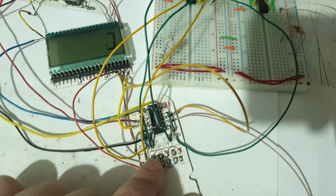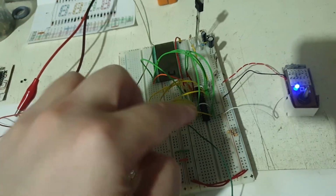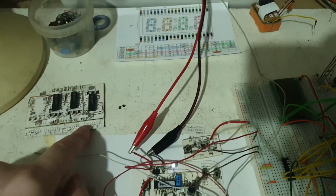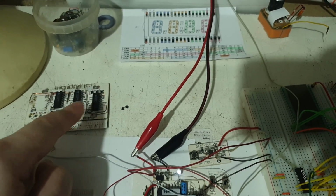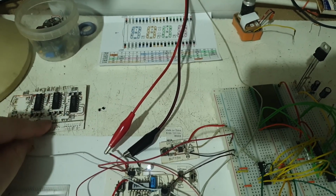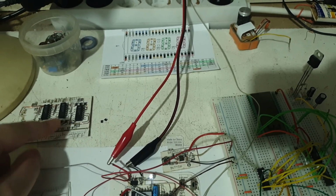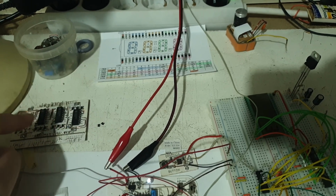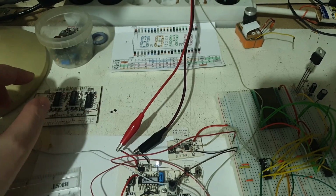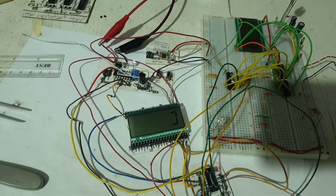So the next step is to take out this thing that I'm having here and put this longer, bigger chip in continuation, exactly like I'm having it here on the testing breadboard. So this idea with the small guys, that I didn't test at all on the breadboard, was an immense waste of time, effort, and everything else. I didn't listen to my own advice to test everything before starting laying down. I was blindly trusting that they would do the same job as the bigger one, and they didn't. They inserted a ton of errors, and also I spent a ton of time mounting them. And yeah, that's a lesson. That's a lesson for sure.